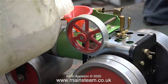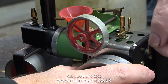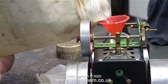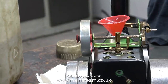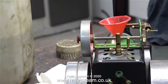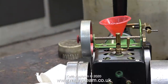It's time I think to fill the boiler. I have an original small Mamod plastic funnel and I'm filling the boiler with water, but it would be a good idea to take out the level plug first so that I don't accidentally overfill the boiler. This is a very small model and so is the boiler. As soon as any water comes out of the hole in the back head it's time to fit the plug. When I tipped the engine backwards a bit of water came out, so maybe another funnel full and it will be ready to go.